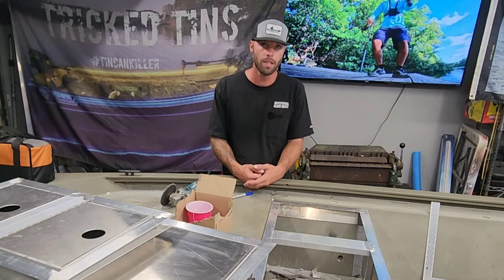So I'm going to put like a 2.5 or 3 inch hole right in this corner. It's going to be buried up inside of this corner panel right here. You're never even going to be able to see it unless you know it's there and you reach up in there. So it's going to be perfect for him to get wires up through there. I also have to run the hose going from his bilge pump up underneath that side with the through hole fitting. He's going to come back and install a rear nav light post into the top of this too, and that will help him run his wires back down and up to where the battery is going to be up in the compartment in the front deck.